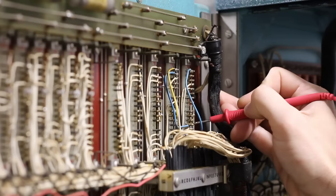Now that everything is clean, let's look at what each card does, starting with the simplest: the D2 card. It is dead simple — just seven diodes that aren't connected to each other in any way, plus two 110kΩ resistors coming off of 100V going to outputs V and L. I have no idea what those resistors are used for, but the diodes are used to make OR gates. Sometimes you need a two, three, five, or six-input OR gate, and having the diodes set up separately gives the designers the ability to pick and choose and build whatever OR gates they want.